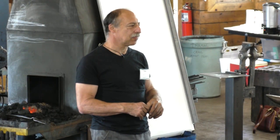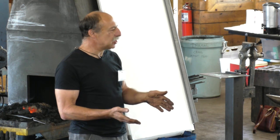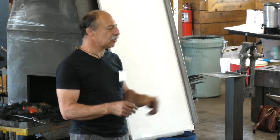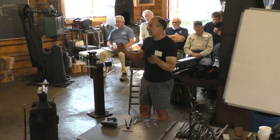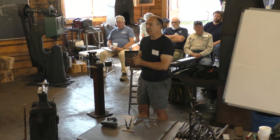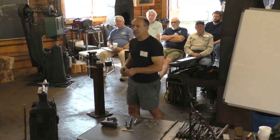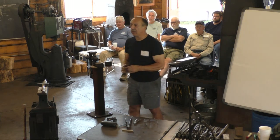But if you did the cast steel, you probably would. No grain in cast steel, no visible, laminar grain. And if you make shear steel out of that blister steel, you still have grain, visible grain in the steel. That's just more evenly distributed. If you look at old iron tools a lot, you can find tools that are marked shear steel. And if you etch the steel in those, you can see the grain that looks like wrought iron grain. But that blade is steel. It's got carbon in it. So yeah, some of the steel did have grain.